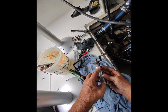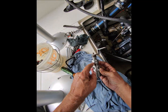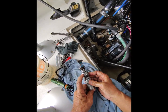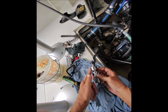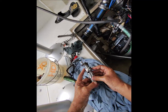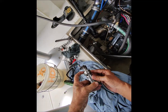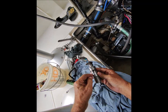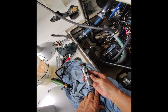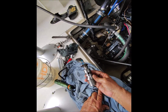I think when they manufactured this part, they drilled through holes, if you can see that or not, but I don't think these holes do anything, to be honest with you. I can't see what their purpose is other than to provide lubrication along this valve. So it's mainly reverse this way, forward this way, neutral, fluids going nowhere, pressure valve would open and dump to the cooler, and all the cooler lines seem to be free. Cooler seems to be not clogged, so I don't know.